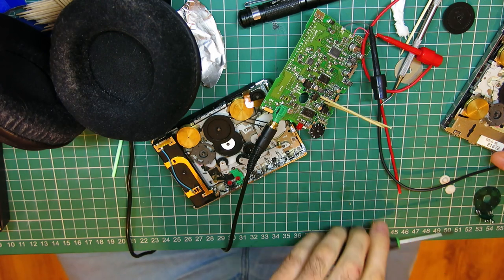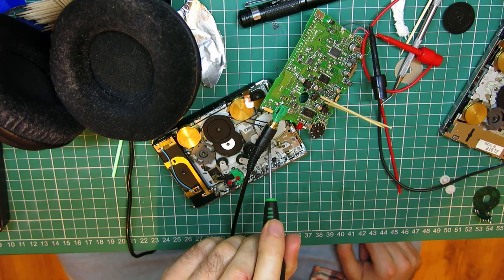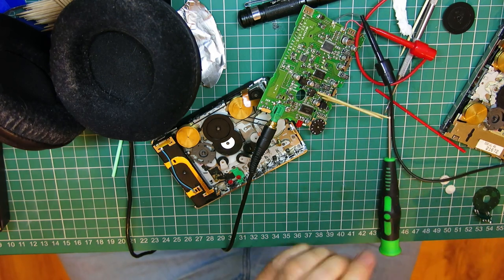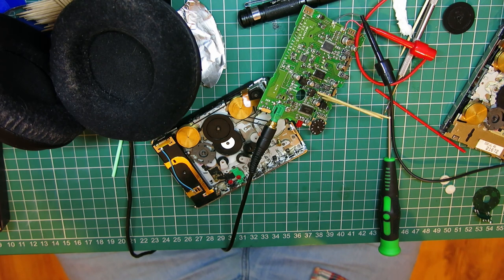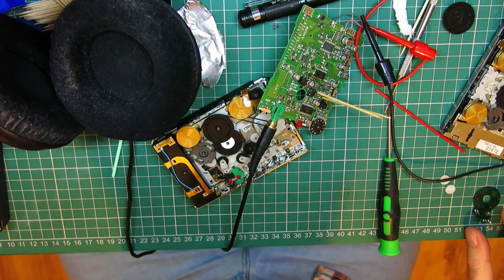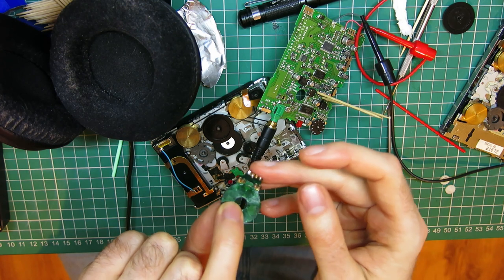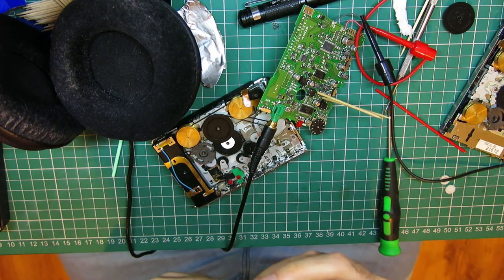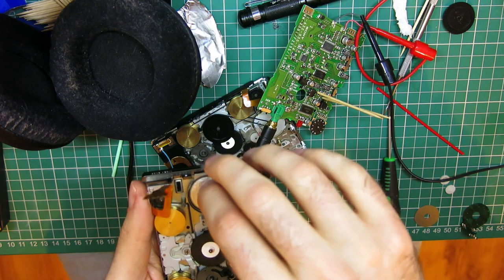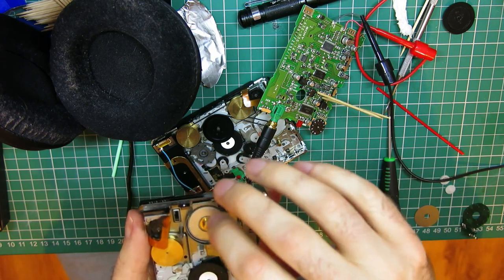So these motor assemblies, these induction motors, once you break this seal around the edge and take this top cover off, there's another little plate that floats on top of a little ledge on the spindle, and floats just above the coil board. That's that little plate there. And then there's a coil board, which is a very thin circuit board with this ribbon cable coming off it, and this part's soldered to the main board, so that's here. And then when you get those out, kind of by force, the magnet of the motor rides on a bearing at the bottom of the motor there. And when they sound terrible, you're liable to think it's the bearing that's gone.